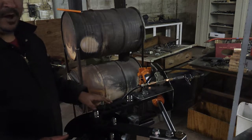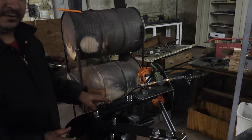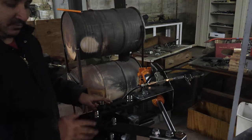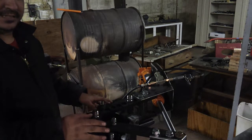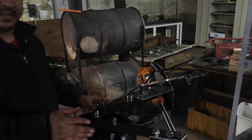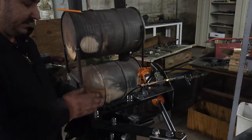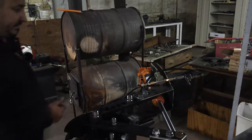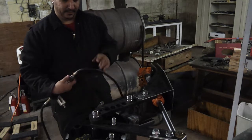This is the point where I'm always going to re-pin — it doesn't matter where I'm at as far as the bend is concerned. I'm always going to re-pin at this point. This is not a 90-degree bend, this is somewhere around 45. The actual bend — the ram will go further, and I'll show you in a second how much further it will go, just so you can see it at full extension and we can look at all the clearances again. But this is at full extension — it gets there, no problem, ready to go. Now let's keep extending the ram so you can see how far it goes.